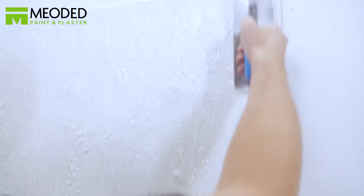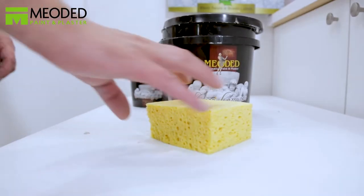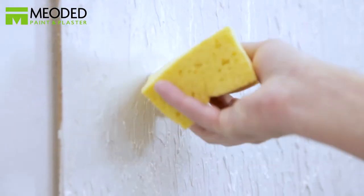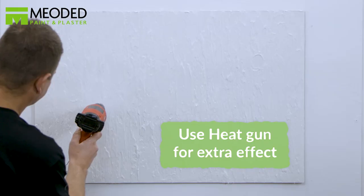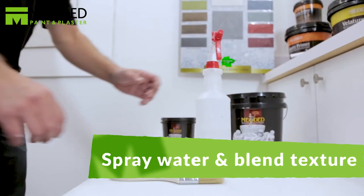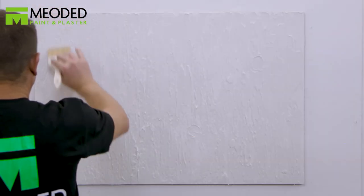Go back over any areas that appear light on material and apply more plaster. Twist the corner of a sponge sporadically into the material, creating an eye-of-the-wood effect. For authenticity's sake, spread this effect out across the surface. For an extra effect, dry some areas of the texture quickly with a heat gun or even a blow dryer — the sudden heat cracks the textured material, creating an aged, cracked wood effect. Now spray water onto the texture and move a clean paintbrush in an up-and-down motion, gently blending and smoothing the texture.